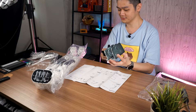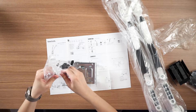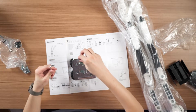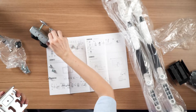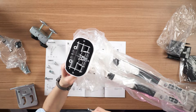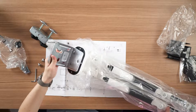The first step is to loosen the clamp. We'll need screw E — the Allen key — and screw C. Rather than slowly twisting, I'll just remove the two Allen key bolts at the back; it's faster and easier. Then we use screw C from the package to attach to the base, aligning the three screw holes that form a triangle on the bottom of the arm. Align the base plate and screw it in.